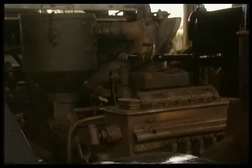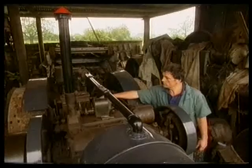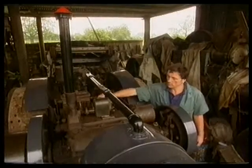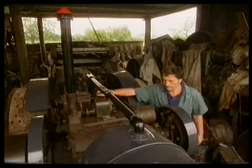The elaborate starting up procedure has a ritual quality. Just like the horse, the constant loss oiling system means that whatever goes in one end comes out the other. The oil rag is the leg of Dad's pyjamas, and the jug was salvaged from the local army camp in 1918. When you start, you put some oil in there and then you wind the handle about 25 times so you can hear it coming, squish out in the bearings.